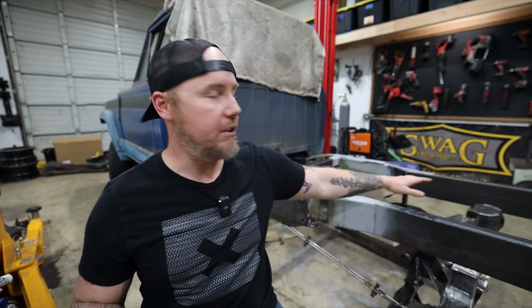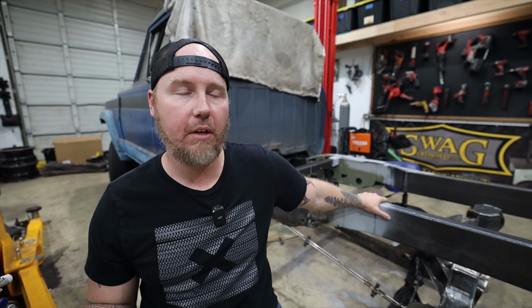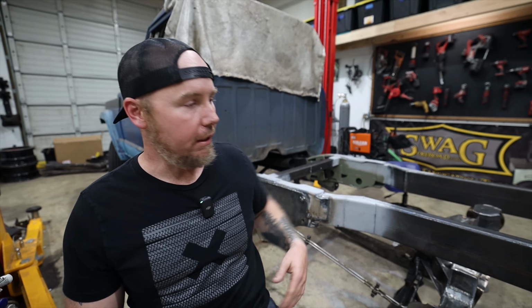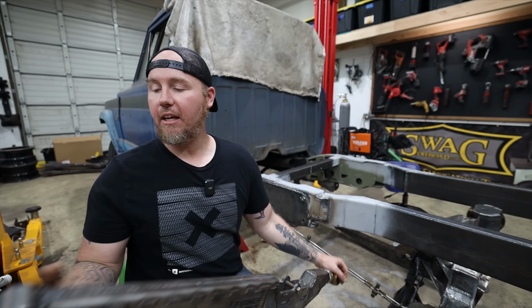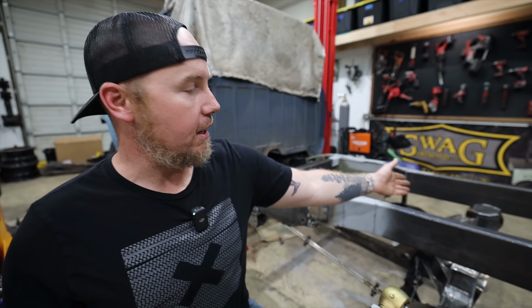And it's actually one of the reasons I wanna go with a wishbone upper. I think that it's gonna help resist our side-to-side movement in a vehicle this heavy really, really well, as long as we can keep that link flat. And so that's what the goal is here. The con is I think we're gonna burn through these bushings often, but I won't know until we test the system. And the good news is I could always go back.